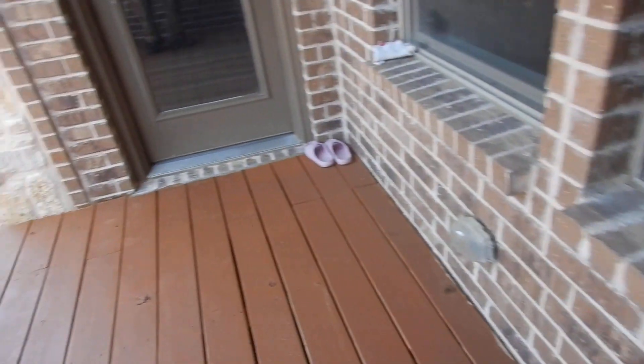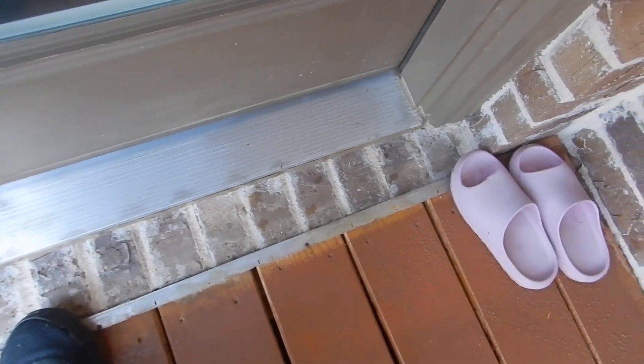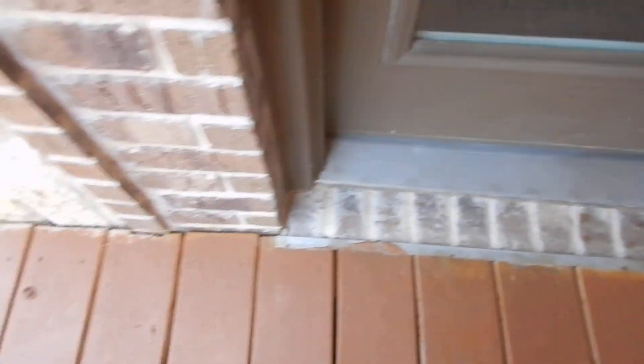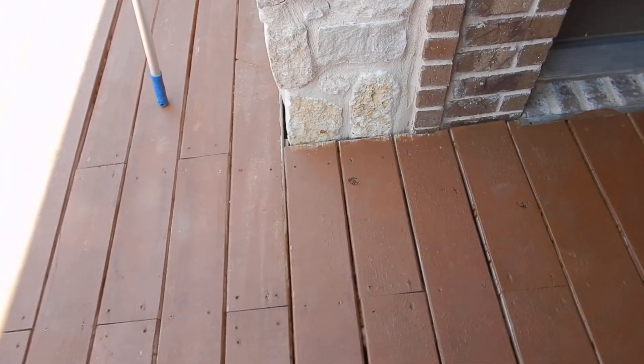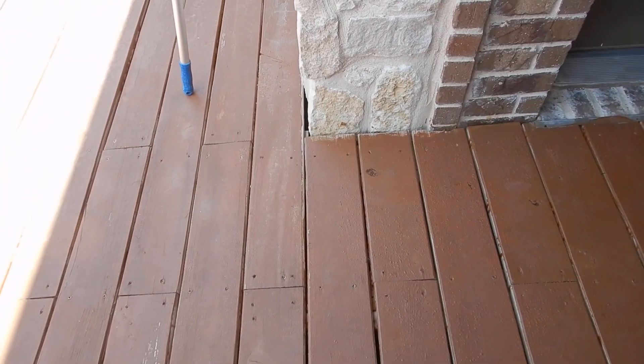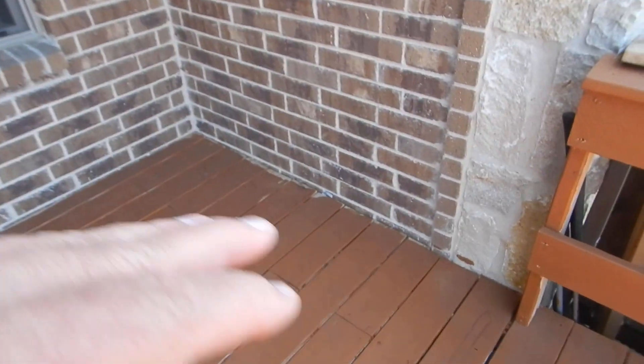We should have flashing around here. We've got just a little bit of flashing right there — just kind of washes your toes. But no, not the wall flashing. So this has covered up our weep holes, because brick is porous.